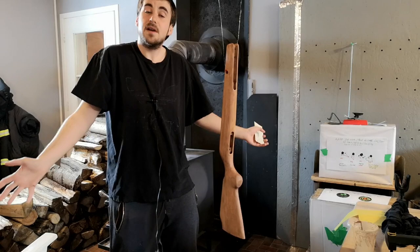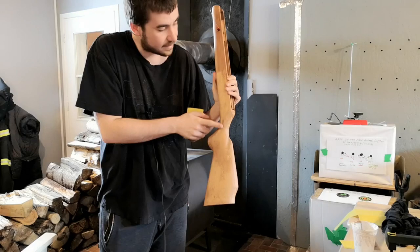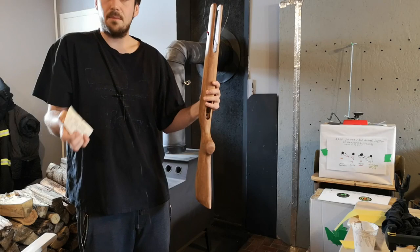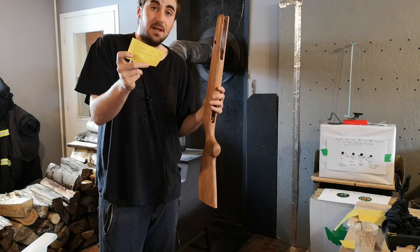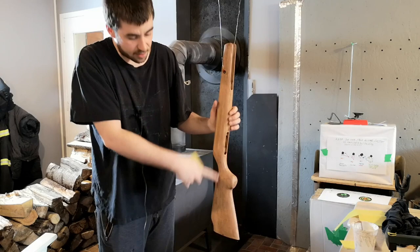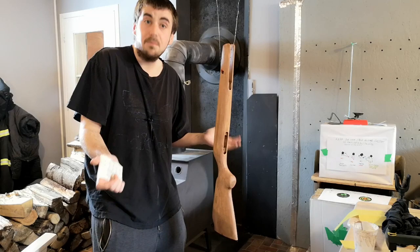What we care about today is sanding down the small parts where I got too much stain. This is not enough. Hopefully we can blend everything together for the next coat. So I'm gonna go over it with a very light sanding with 320. This is mainly to try and blend the nice part with the bad part, and the next coat will maybe make it look better. Skip to the time lapse.